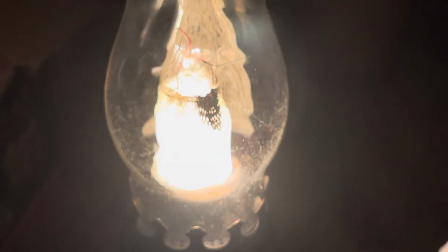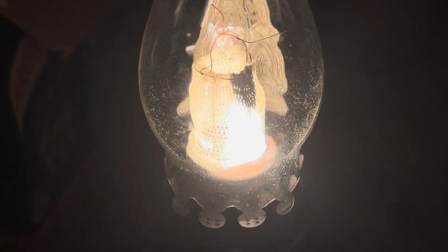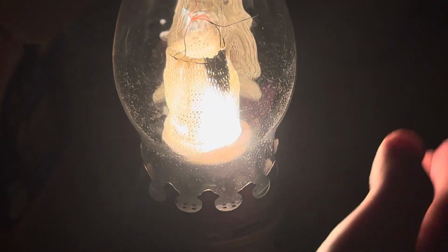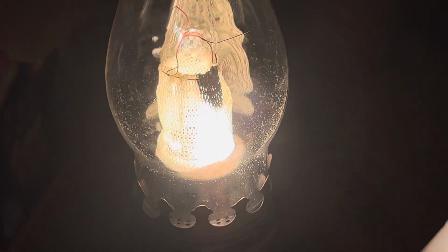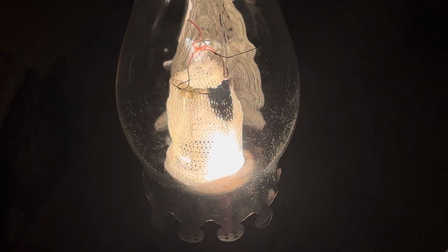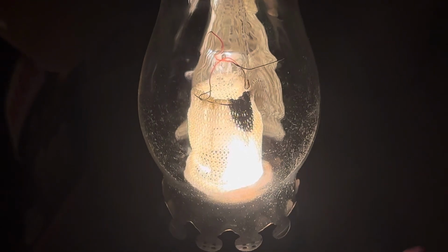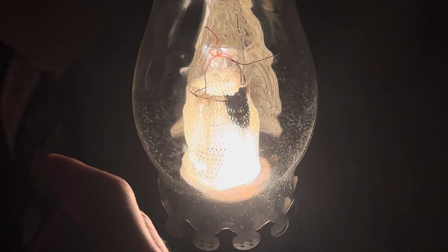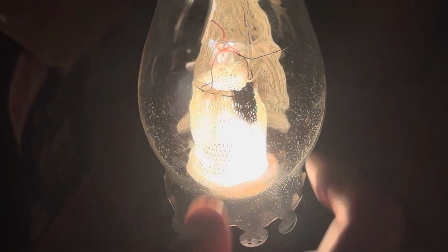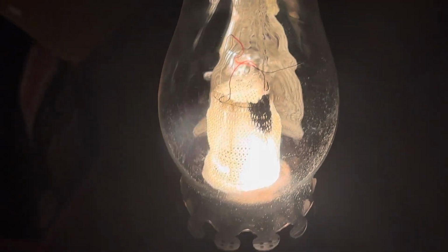If it's really high, it damages a lot of the mantle really quickly, but it gives you a lot of light. So right now, I would say it's about 20 watts incandescent brightness. But actually this one should be rated at 120 candle power, which suggests it should be at least like a 100 watt bulb. So I probably need to work on a better way to provide an even more refined shape on the mantle. And that's it. Thanks for watching.